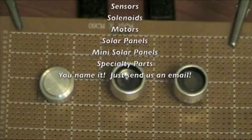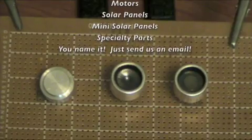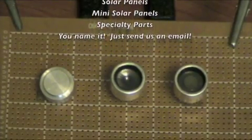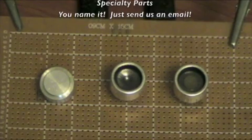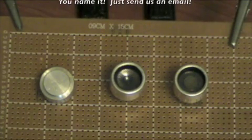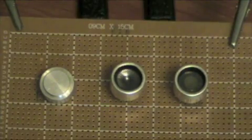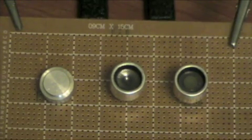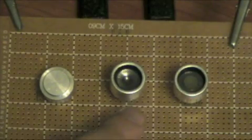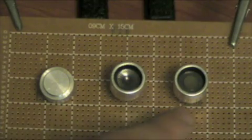It handles moisture well and it's good for outdoor use. They can be used as transmitters or receivers. Secondly, we've got the 25 kHz ultrasonic transducer in the middle, which really isn't in the ultrasonic range — it's between ultrasonic and audio. Younger children can actually hear the center frequency, which is 25 kHz. If you want to build something that's going to annoy your dog, both the 25 kHz or the 40 kHz on the right are best for deterring any animals.